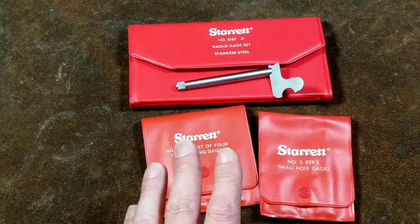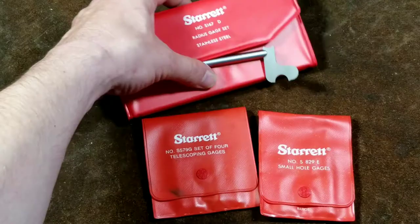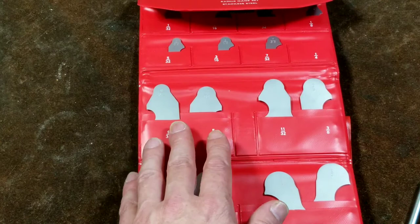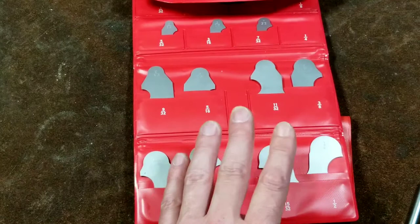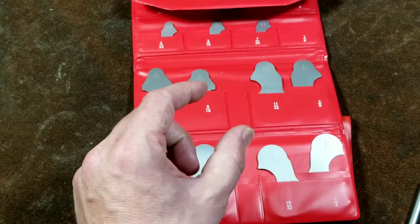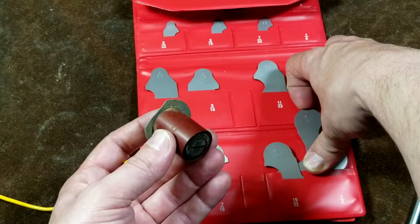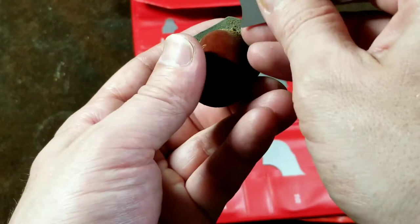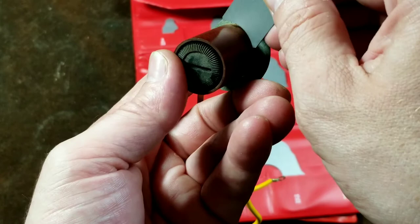Now here we are at the radius gauge set, which probably wouldn't be the most used type of tool, although it is quite handy whenever you're trying to file a piece of metal and get it to match a curve. There's also been a surprising number of situations where these help you determine the diameter of something without having to totally disassemble it, especially when you can't get a measurement across two points. Say like this brush — if you had to drill it out and just a little portion of it was exposed, maybe 25% of it, a radius gauge would allow you to see that it's a one-inch diameter, so you'd choose a one-inch or slightly smaller drill.